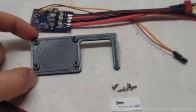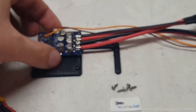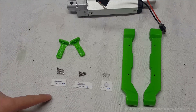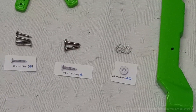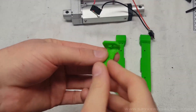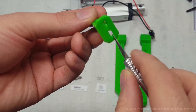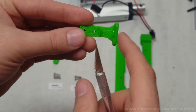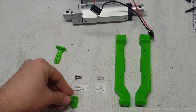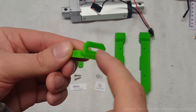The Spyker Cat kit will come with one more electronics tray, and the one with four bolt holes is meant for this. Using these screws I'm going to put this on there — there it is mounted. To get ready to install the actuator we're going to need these parts here. These screws are all in your Spyker Cat hardware kit. We need these plastic parts, and they have some support material we need to clean up. It's a little tricky because you can crack the layer lines if you go too crazy — I included a third one just in case. Use the table as a backstop to slice through, so it's like a slot, then use a file to smooth it out.